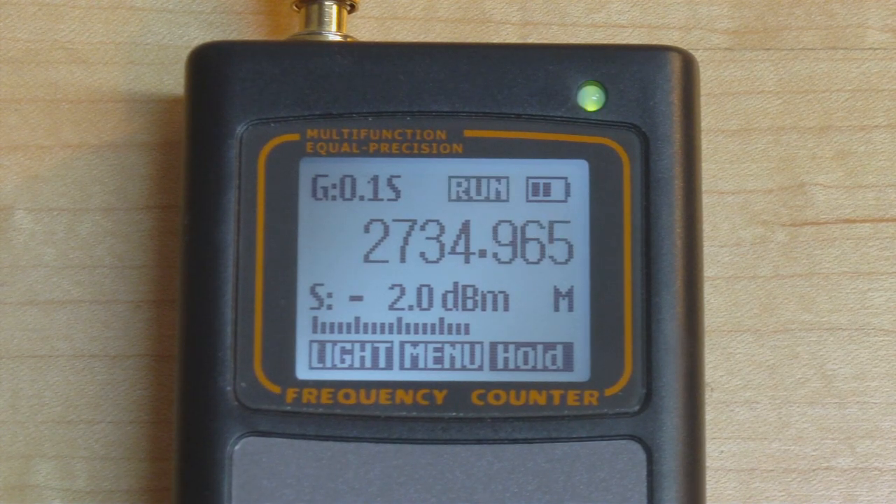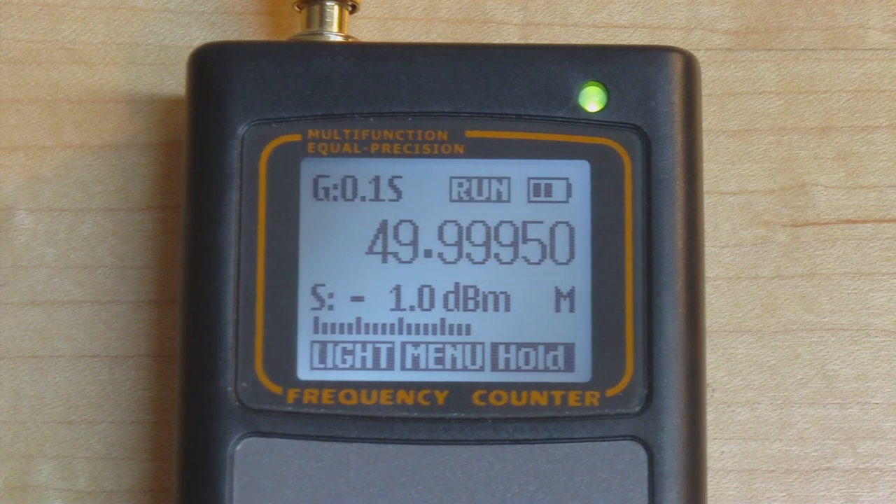It's great that we get about 100 MHz of over-spec performance. Testing the lower boundary at 50 MHz, we get a really good reading. Setting the synthesizer to 33 MHz — quite a bit below the 50 MHz spec — we're still getting a good reading. So even though it says it's limited to 50 MHz and above, it seems able to reach quite a bit lower.